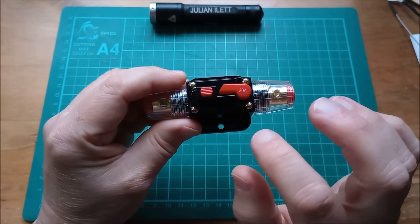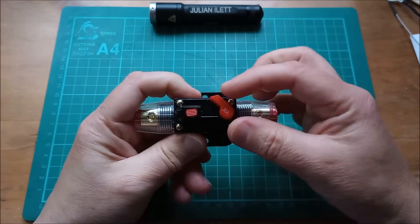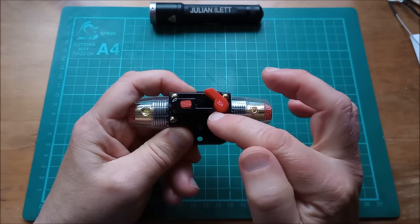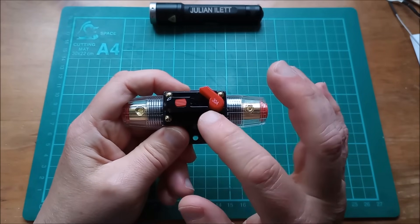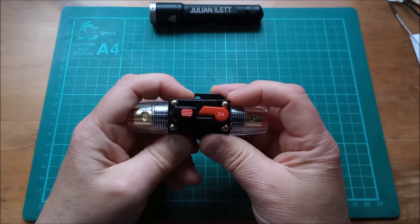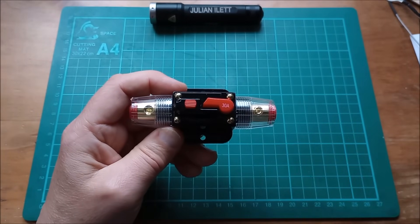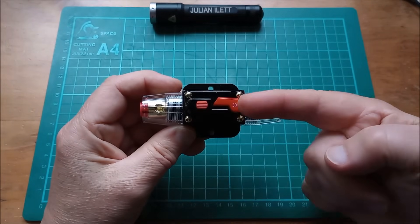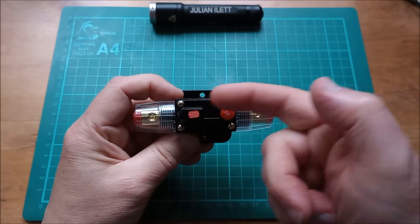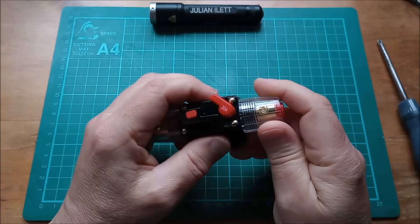The way this works is that at around 30 amps the contact inside breaks — it's the equivalent of pressing this button. This piece of plastic rotates and there's a little foot inside which is slightly offset from the flag, and it wedges itself between the two contacts. It's a bimetallic strip inside, so even when the strip cools down and attempts to remake the contact it can't — it's a one-shot disconnect. You then have to move the lever to reconnect, which is good because you don't want your fuse making and breaking periodically. The convention is that when the lever is in the direction of flow the circuit is made, and when perpendicular the circuit is broken.